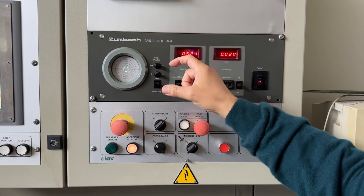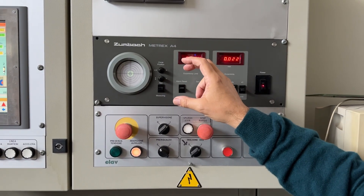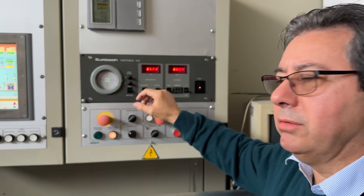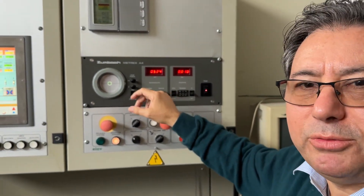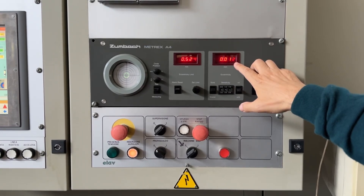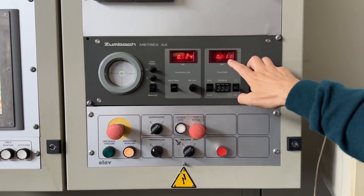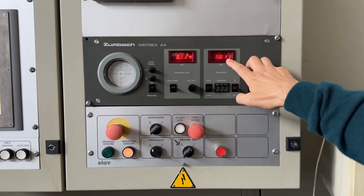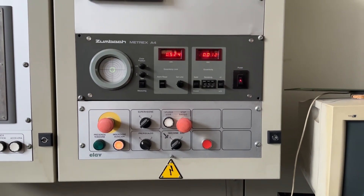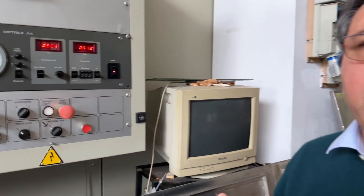This is one of the reasons why we don't want people to squeeze the cable, trample on it, kink it, or run over it with a pickup truck. As you can see, the tolerances have to be extremely tight — we're talking about hundredths or thousandths of a millimeter. The tolerance can be 0.05 mm plus or minus on small cables, or 0.10 mm on the big ones.